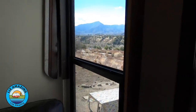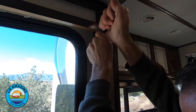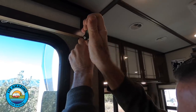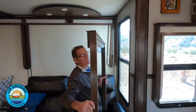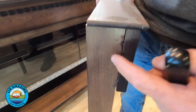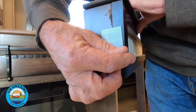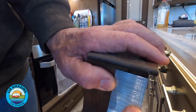The next step is you need a Phillips head screwdriver. There are screws down in here — it screws right in here. The good news is they're just going into whatever these walls are made out of, a fiberboard. You can see the gap here — this is coming loose from this. You want to make sure that your brad is long enough to go in deep enough into the anchoring piece. You can see it's going in probably three quarters of an inch.